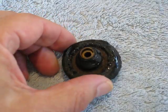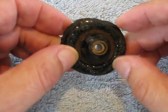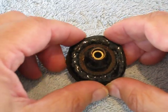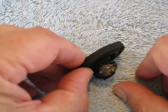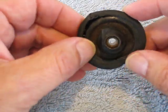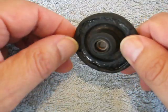I'm going to show you some examples of some that cannot be rebuilt. Look at this one — this one is cooked. You can clearly see it's melted everywhere. That is beyond repair. Now, this can be sent out and all the rubber can be taken off and they can rebuild it that way, but it would be impossible for me to rebuild it using common tools. That likewise goes for this one — you'll notice it's actually got a gap in here, a flat spot against the section that ran up against the turntable. And it's just too far gone. Nothing you can do with that.